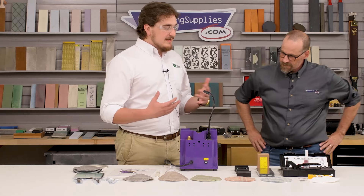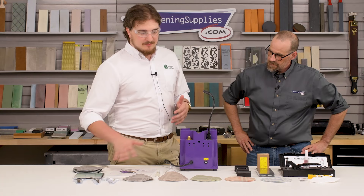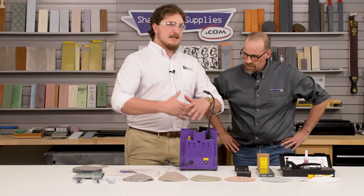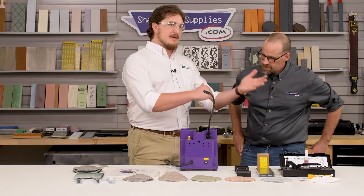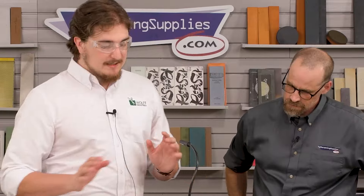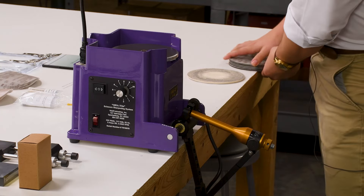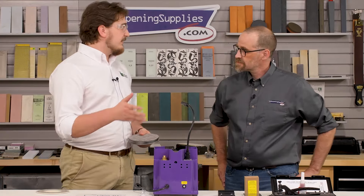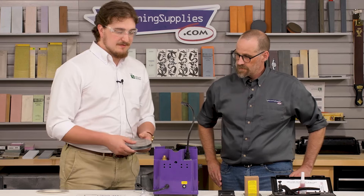So it's a very easy step. If you follow the process step by step, the principles of sharpening would dictate that you start with your coarsest grit and work up to your finest to remove material systematically and polish. We'll start with our 80 micron, working down to 60, then 30, then 15, followed by nine, and go up to our diamond paste high polish compound if needed.